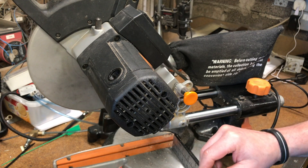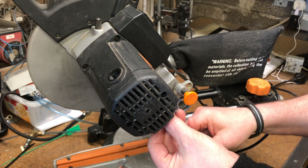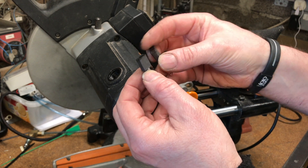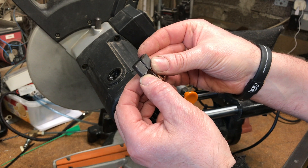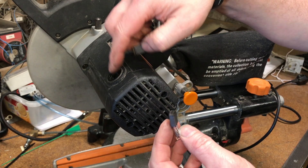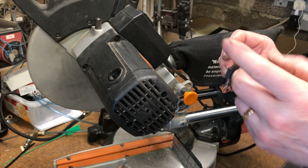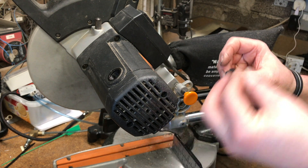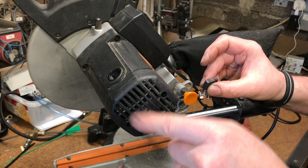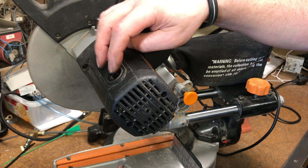If we pop out the lower one — it's at 180 degrees to the top one — you'll see these are slightly different lengths. One is about a millimetre longer than the other. When they arrived today they were identical lengths and a little bit longer than that. So it's not just a matter of bedding in. The armature has an issue — either the armature's worn out the old set of brushes, or the old brushes weren't changed quick enough and it's arced a little bit, causing a problem on one of the segments.